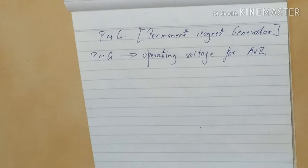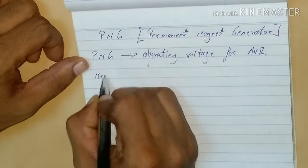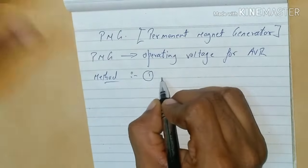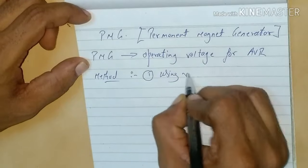To perform this, AVR has to have a steady operating voltage. In most applications where there is jerk loading — that is when alternators are used in places where load is increased and decreased within a short span of time — it's very difficult to maintain a steady terminal voltage. That's when PMG comes into the picture. In other words, PMG supplies operating voltage to the AVR. Basically there are three ways to give operating voltage to AVR: one is from the main terminal of the alternator, that is R, Y, B.